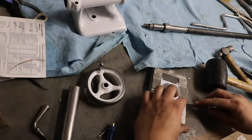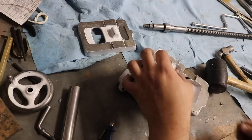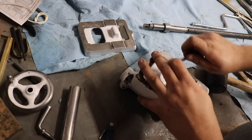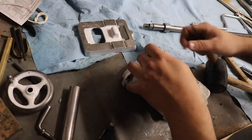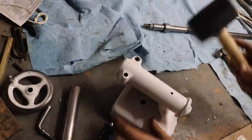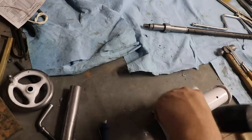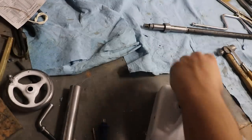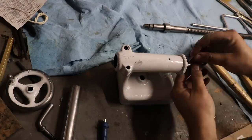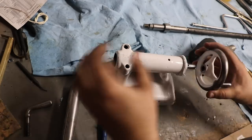You can see the very original hand-scraping marks on the base for the tailstock, and I'm being very mindful of them as I gently clean up the paint along the edge. The spindle for the tailstock, as well as a lot of the hand wheels and other high-polish items, I ended up taking to my buffing wheel. They were in really good condition after cleanup but could use that final luster, and I gave them a little polish — I'm really happy I did because it also made them a lot smoother.